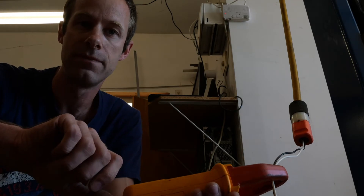Let's go back to the GFCI. What we just saw was an example of a current transformer — that's what the fork of a clamp meter is. It takes an amount of current that's traveling through the wires, transforms it down to a very safe level, but then converts it into a voltage that any meter or device is able to read.